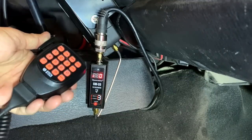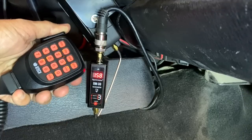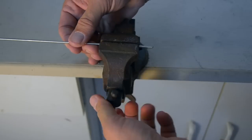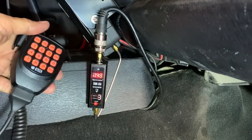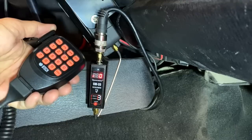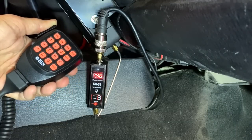After trimming off a few millimeters we try again — 1.58 to 1, that's a little bit better. Another trim brings it to 1.48 to 1. Then 1.46 to 1 — not too bad. That's really all there is to it: measure, cut, measure, cut, until the SWR is as low as you can get it.